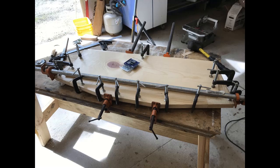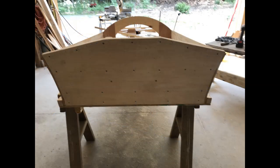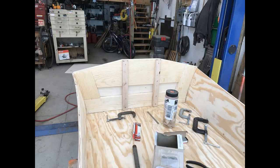The transom is inserted between the two side walls at the rear and put together. It takes a bit more effort than you would think. The angle puts a lot of tension on the sides as you draw them in. You'll need a bunch of clamps here as well, and you'll need to pull them tighter in the middle to make it fit the actual angle. It works fine — it just takes a little bit of extra effort.